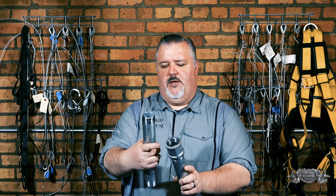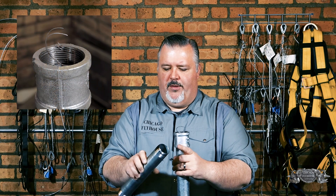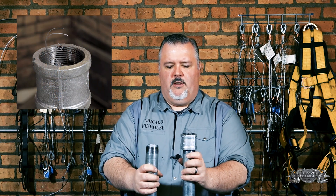Looking at those tests, it's pretty clear reasoning behind why we don't use threaded couplers. The internal batten coupler was able to take the full 3,000 pounds of load, whereas the threaded coupler blew apart. We can see the threads have very definitively ripped out — on both the pipe and on the coupler itself the threads just tore away under much less force than the full 3,000 pounds.